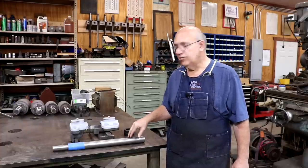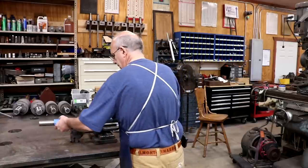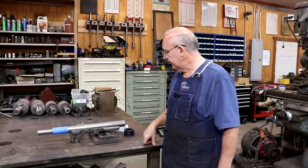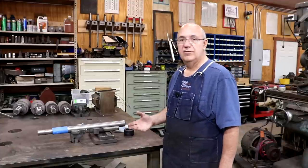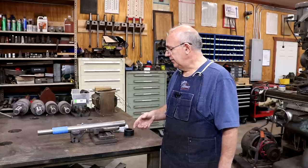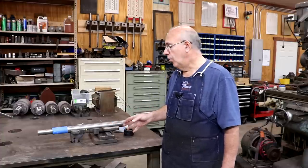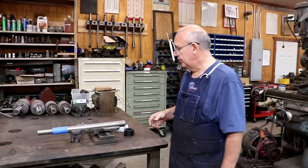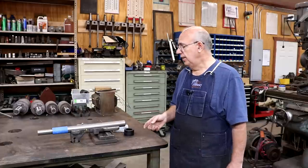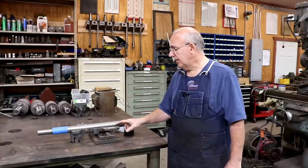Game plan for the day is I want to get these Babbitt bearings poured. This is the housing that this fits into. We've got an upper and lower bearing shell. The shaft is basically just going to sit up in here, and we'll pour Babbitt in there to position it in place and give us our bearing surfaces. Babbitt is a soft metal - we're going to be using a tin-based Babbitt today. You pour it to fit the shaft, scrape it in, and that shaft runs on that softer metal on a layer of oil. This was commonly used before ball bearings were invented. This bandsaw being over 100 years old, dating from the late 1800s and early 1900s, really predated the common use of ball bearings.